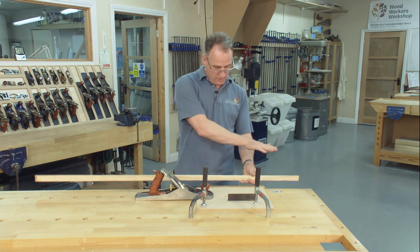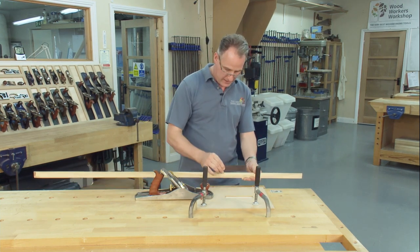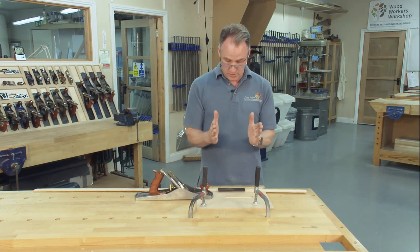If I've got that edge done and I've prepared all my timbers to that stage, I would move the batten in the vise up to a fixed position so all of these could be dropped back in and planed down to a desired width. The only thing left to deal with is doing the end grain.